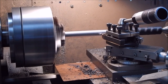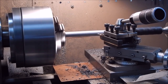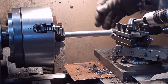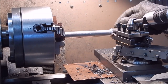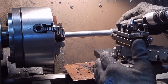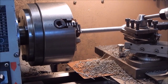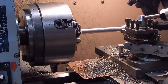We're on intermediate now and the finish is a lot better. This is where the quick change gearbox makes it easy to swap across from coarse to medium and then do your fine finish at the end, without a lot of messing around or crawling along at dog-slow speed on the finer feed — quick change gearbox is the way to go. Now we'll go to fine feed and use a shear tool. I'm going to leave this shaft fairly thick — this is heavy duty work — and we're using high speed steel.